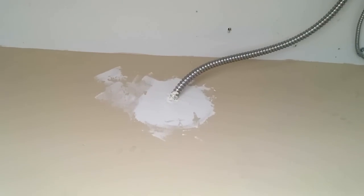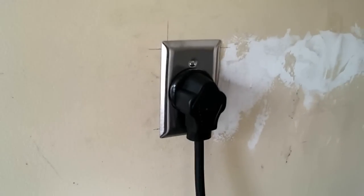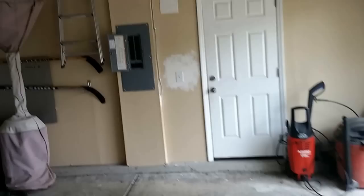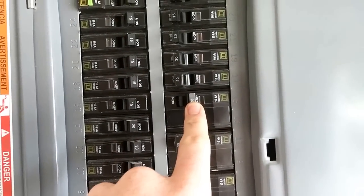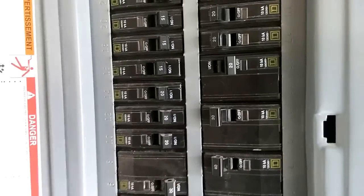Another hole in the wall goes down the wall into the actual receptacle. So to recap: 50-amp plug, 50-amp receptacle, 30-amp wiring, 20-amp breaker. Just as a distinction, the breaker is designed to protect the wiring that's in the walls or in the conduit — it's not designed to protect the appliance.